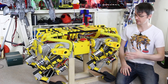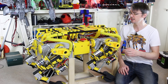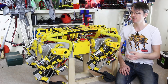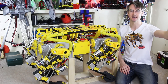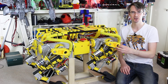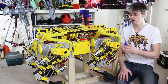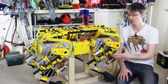So what's the conclusion of all this? At the moment we've got very precise, accurate, and stable position control of every joint using the ODrive and its encoder. The test we've done involved putting analog pots everywhere with those analog wires. We'd need quite good quality pots to get a more stable answer, but there are still quite a few issues. Obviously if any of the pots become disconnected, the ODrive is going to keep driving in velocity mode and not slow down or stop, overshooting its end stops — whereas if we have the ODrive positioning with the encoder, the closed loop control happens within the ODrive, and even if the Arduino powers down the ODrive moves the joint to its position and stops. So I'm inclined not to get rid of this incredibly precise stable position control, but I do need some other answer to calibrating on power-up without having to home the end switches.